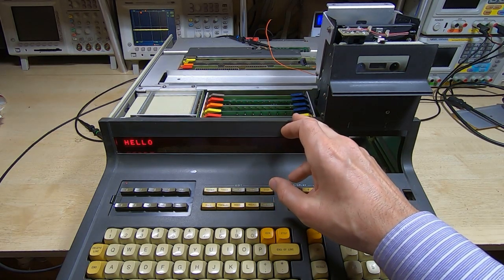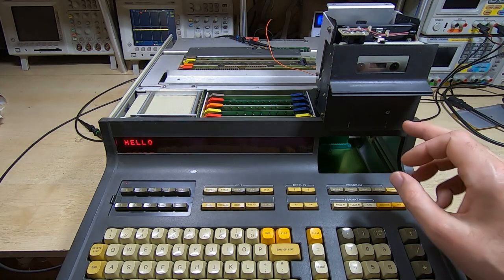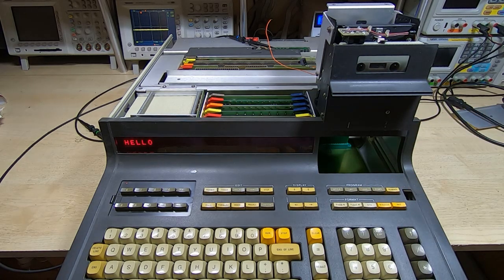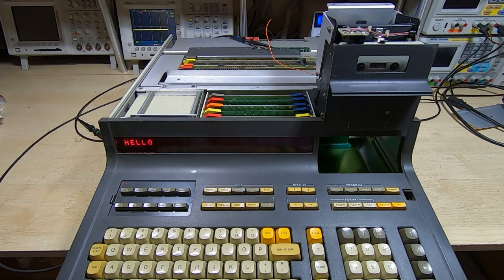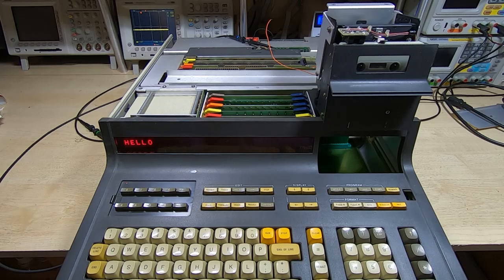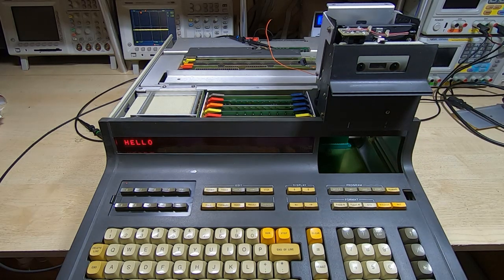I did find some evidence that one of the contacts on the edge connector that card 61 was plugged into may not have been making good contact, and I've corrected that — bent the contact back to how it should be and cleaned it. I couldn't find anything wrong with the connections to board 63 or the tape drive itself. It might just be that there was some dirt in there and taking this out for testing is what upset it. Either way, it's working fine now. The end-of-tape detection is now very reliable — 100% where it was flaky before. I'll replace the pot and resistor with a fixed resistor of the same value and get this put back into the machine.